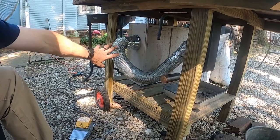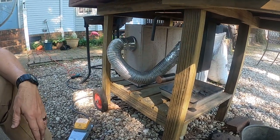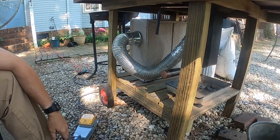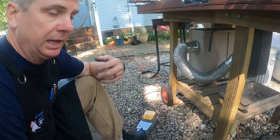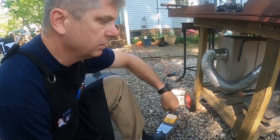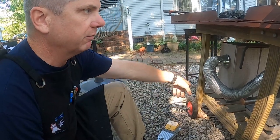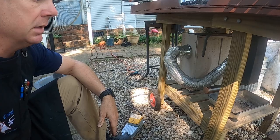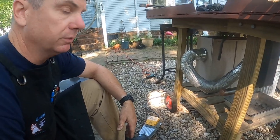So you've either got to have an electrically powered fan or a bellows, if you're talking really old-fashioned, or a hand crank blower. A lot of times at a blacksmithing demo, you'll see them turning a hand crank. But you've got to have a means of forcing air up into your fire pot to get the fire as hot as we need it for forging.